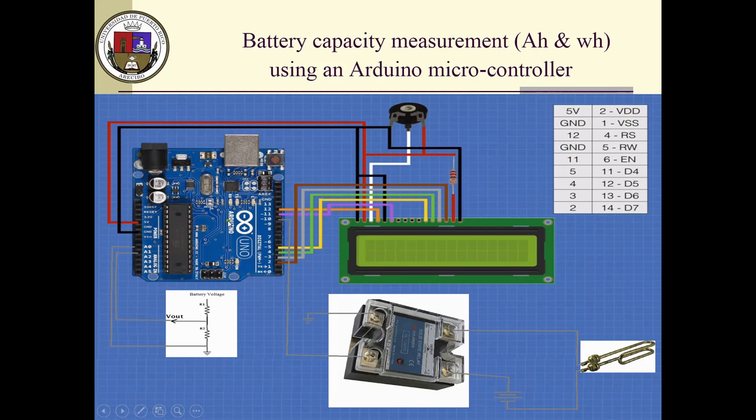So the Arduino, when you are ready to measure the discharge process, you close this relay here, and then current will go through your heating element, again discharging the batteries. The other part is that you have to measure the voltage into the analog pin, as shown here, A1. You do that through a voltage divider and get the proper voltage. And as the battery gets discharged, you monitor that, and then you get amp hours and watt hours, and everything will be displayed here. Again, this part of the diagram I took from a YouTuber. Credit will be provided at the bottom in the description of this video.